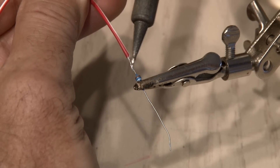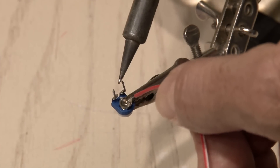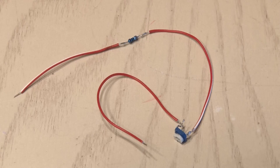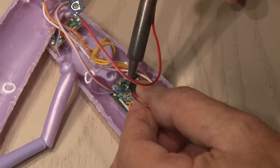So, I'll solder a small wire to a resistor, solder that wire to one of the legs of my potentiometer, another wire goes to the other leg of the potentiometer, and then another small wire coming off the other end of the resistor. The resistor is just gonna help protect the circuit. Once our circuit bending circuit is done, it's time to wire that into Mr. Fear.